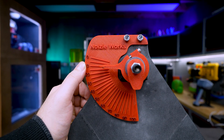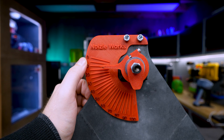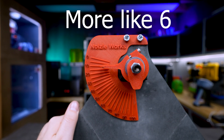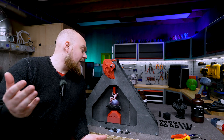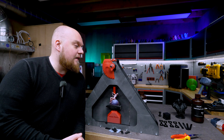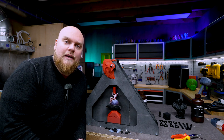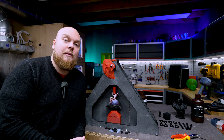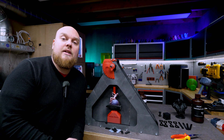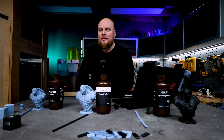The Engineering Pro is a bit more inconsistent — we are seeing results going up to 10% but also down to 4%, so let's say it's somewhere in the middle at around 7% impact resistance. Interesting results: the Standard Pro performed at about 5%, the High Speed at about 2.5%, and the Engineering Pro between 4% and 10% maximum. We are seeing more inconsistent results on the Engineering Pro — perhaps due to internal stresses during printing. But we can definitely see the Engineering Pro is doing a little bit better on impact testing than the normal resins.